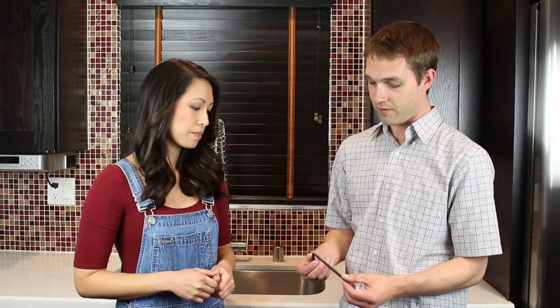When you're doing the dishes and your sink drain won't drain — it's stuck with food and filling up — well, you could call a plumber or you could buy a five-dollar tool and save yourself eighty dollars. What you can use is an Allen wrench, probably a quarter-inch Allen wrench, like the big one you get from Ikea. Sometimes when you turn on the garbage disposal you hear the motor running but nothing is spinning — that's the issue, and that's what you would use the Allen wrench for.